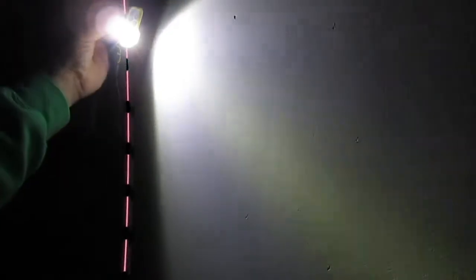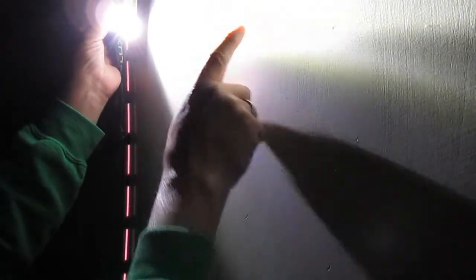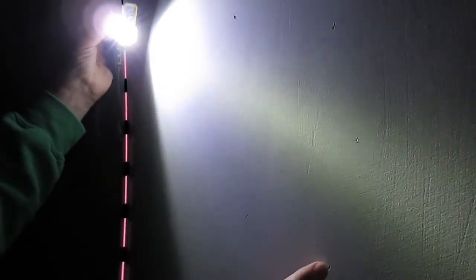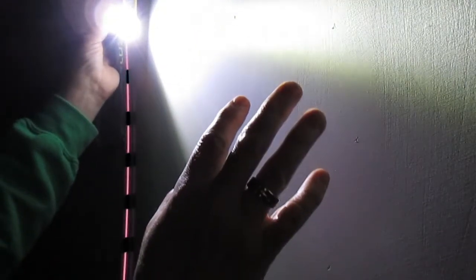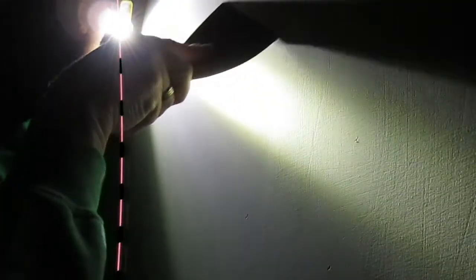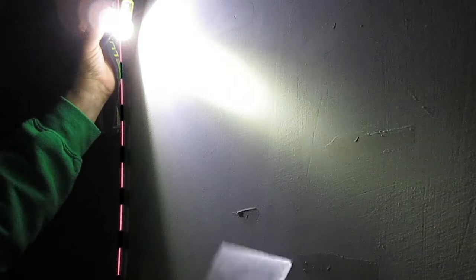I take the light and put it on an angle like this — you can see the light in my hand. I shine it sideways on the project, and I can see here, and here, and here — some bubble holes from the drywall from when I sanded, because it's got some bubbles in it. So what I do at that point is take a little bit of mud on my knife, go over it, force it in, scrape it off — just like we learned before.